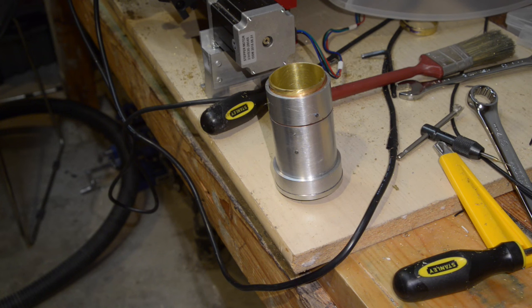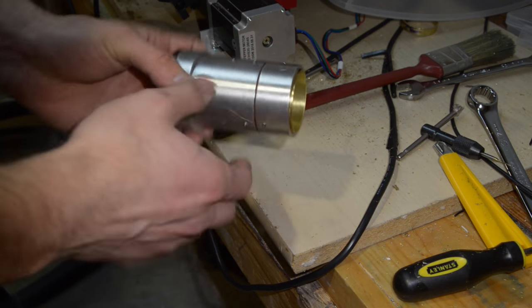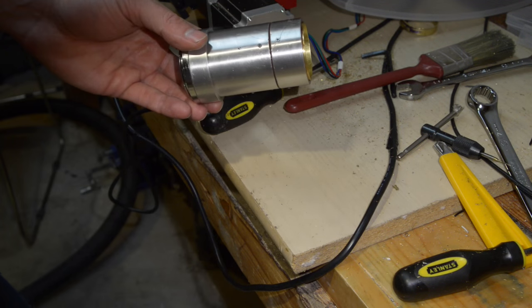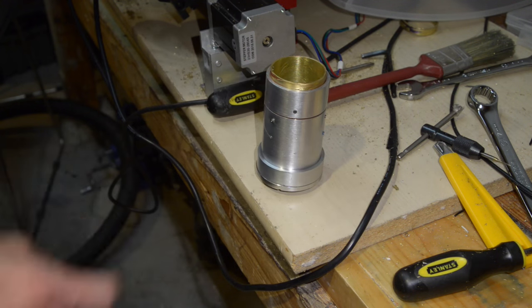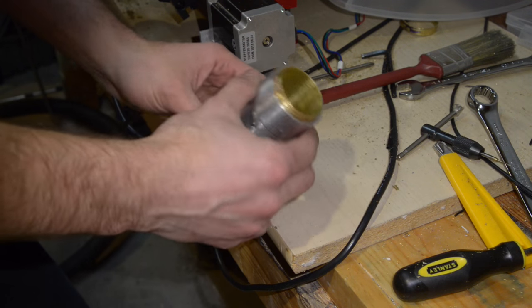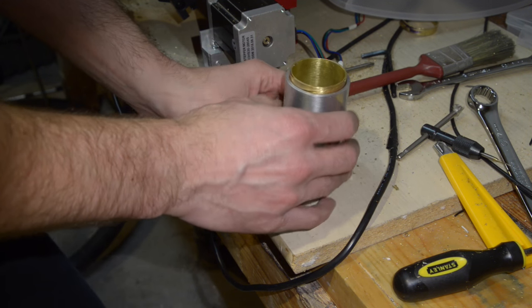Done in the sense that it's together and I can do my intended motion — I can rotate and move that thing in and out. I've got the F-mount mounted, but I've learned a lot. The biggest thing I've learned is patience. I made a bunch of mistakes along the way — probably the biggest was not coming up with a full written-down plan before I started. I was winging it, and when I made mistakes I'd think I could deal with it in post. For example, when I drilled these three holes, I got their positions by wrapping tape around the outside and dividing by three — that was not an accurate method. That inaccuracy, combined with one of the helical screw holes being off, made it really hard to put this together smoothly.